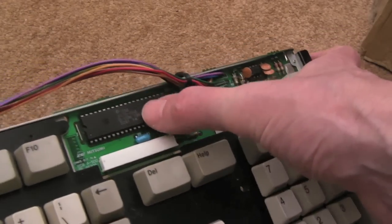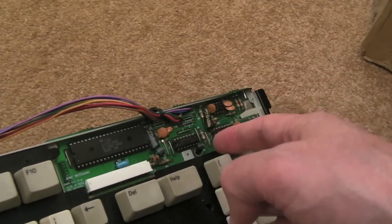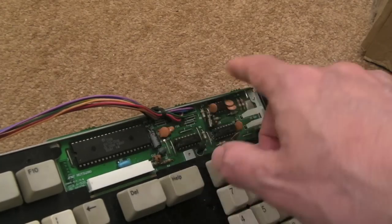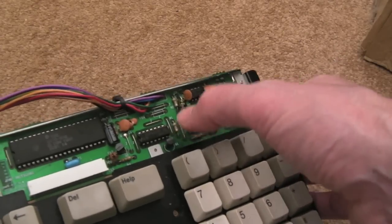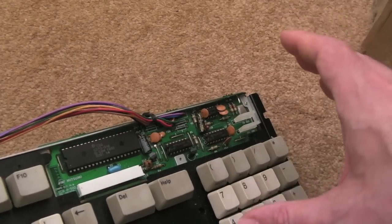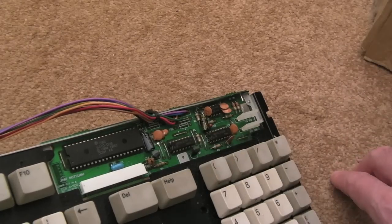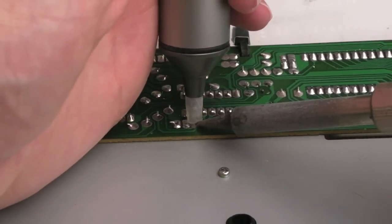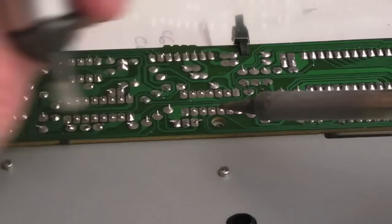If you remove Q1, you've got no ability to reset the 555 with Ctrl-Amiga-Amiga. How that back-translates into the MCU being able to configure itself — it depends what happens on power-on, whether it simulates those three keys in order to reset the 555 and detect that process. It might work but I'm skeptical — we'll try removing Q1 and see if it's capable of resetting an A2000. Q1 is here and the pins are bent right over — I hate that, it makes it so much harder to remove.